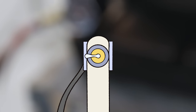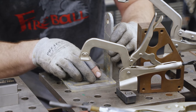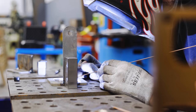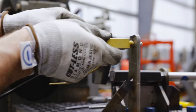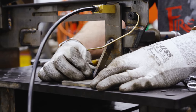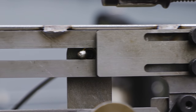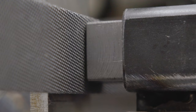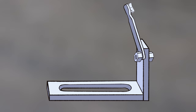I need to build a bracket that's going to hold a switch. The switch's job is to turn off the air so that the cylinder can return back to neutral, bringing back the coupon. This switch bracket is going to take some serious abuse, so I'm making sure to add some gussets and making sure it's nice and strong. I'm using the Fireball Magnetic 1-2-3 blocks — perfect for this type of setup. In order to get it to lift on the return stroke, we're going to use this toggle switch inside this bracket. So we got our switch mounted to the bracket and the switch goes into the slot. This is an adjustment plate and these are the stops — this sets where the cylinder is going to be pulling in and out, tripping that switch back and forth and hitting those two bump stops. This cylinder is a spring return, so when we apply air to it, it's going to go out. When the switch hits it, the air gets bled off and the spring returns the cylinder back. I want to remove the variable of chips getting clogged into the file, so I'm adding this chip wiper.